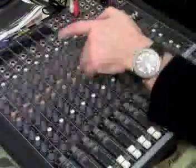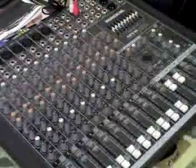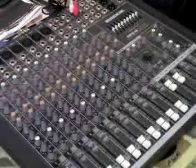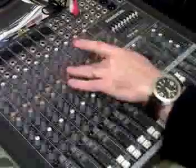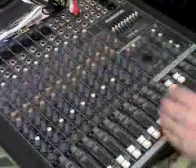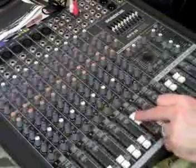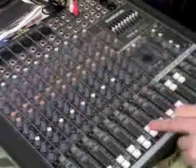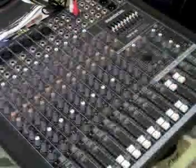The yellow auxiliary sends are essentially the same as the red ones. The main difference being they are always post fader. So there's no selection switch on these. The signal always leaves the desk after the fader. So the signal leaving the desk will be affected by how much the white fader at the bottom of the channel strip is moved.